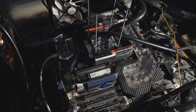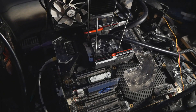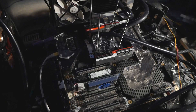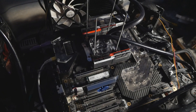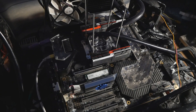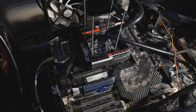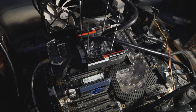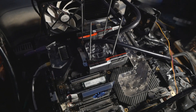Especially if you use the motherboard on Sub-Zero cooling on the CPU. But it doesn't have to be run below zero - it can occur even just in normal use. If you just use air or water cooling on the CPU, it can still happen. It's a very common issue among these modern motherboards since the launch of the Z87 or Z97 chipset.